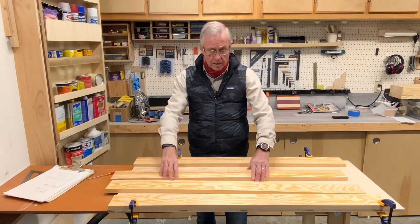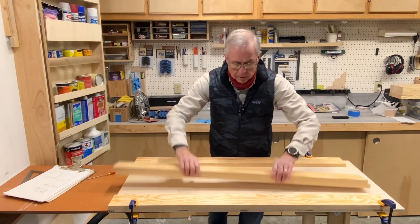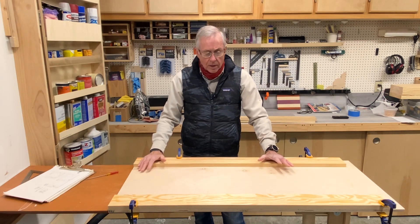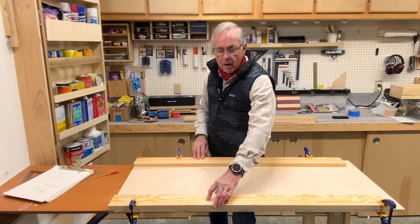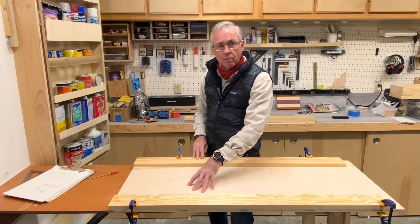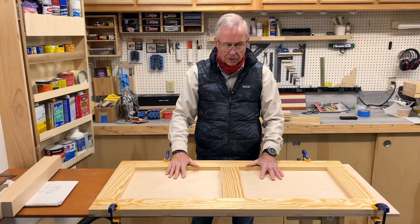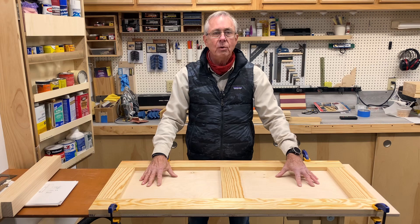The first thing I did was cut the top and bottom pieces that will make the front of the frame. Next I need to cut my uprights to fill in with my one-by-fours on the front and back. In theory my plywood is 20 inches wide and each one-by-four is three and a half inches, so three and a half plus three and a half is seven inches. Subtracting that from the 20-inch plywood, you need a 13-inch piece to fill in the gap. Here are our uprights cut for the frame — you can already get a sense of what the front will look like, with the outside frame and the plywood behind it.